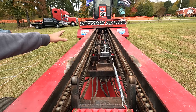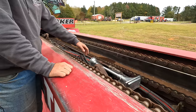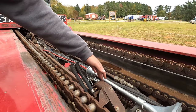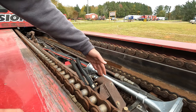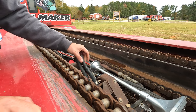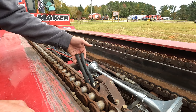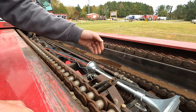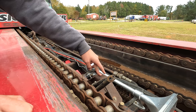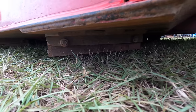There's also an air horn — that's for pulling antiques with a speed limit. There's our trip switch, slid all the way in the forward position right now. The hydraulics hold the back of the pan up. There's a bolt underneath the box that when the box passes over will trip two micro switches inside the housing, which will release the hydraulics to let the pan fall down onto the ground and start doing its digging.